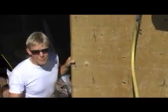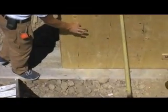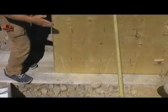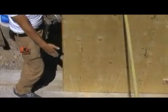A critical aspect of pouring a vertical concrete wall is the plate on the bottom. The snap ties stop the wall from expanding too much. The bottom plate prevents blowout on the bottom. It's a critical part to have in place.